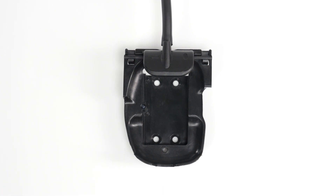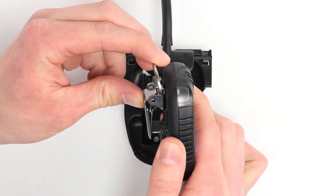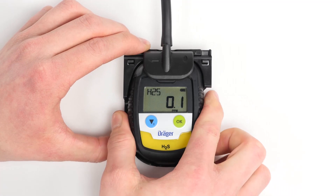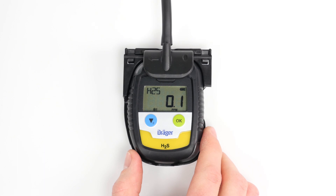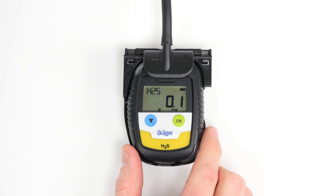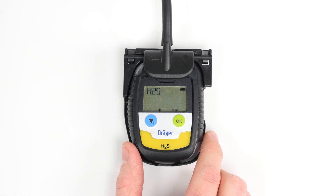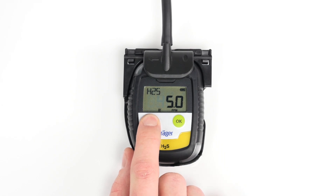The sensitivity calibration serves to calibrate the sensors to a pre-set gas concentration. Raise the clip on the pack, attach the calibration adapter, and connect it to the test gas cylinder. In order to carry out a sensitivity calibration, press the menu button to enter the menu. The icon for span calibration will start flashing. Confirm with OK to start the sensitivity calibration. Once the calibration icon begins to flash, you can set the calibration concentration. Press the blue menu button to adjust the concentration and press the green OK button to confirm the concentration.